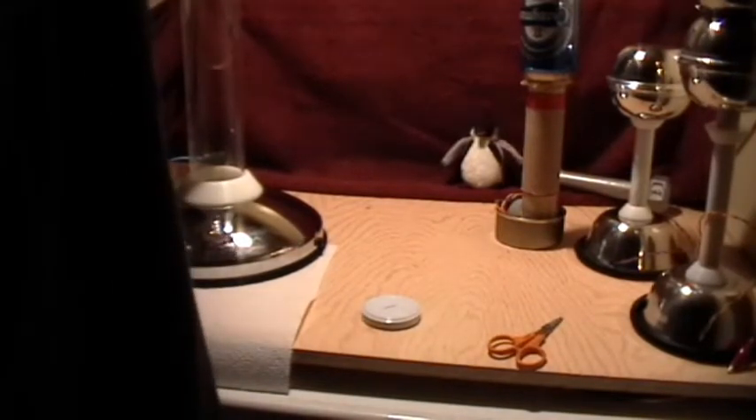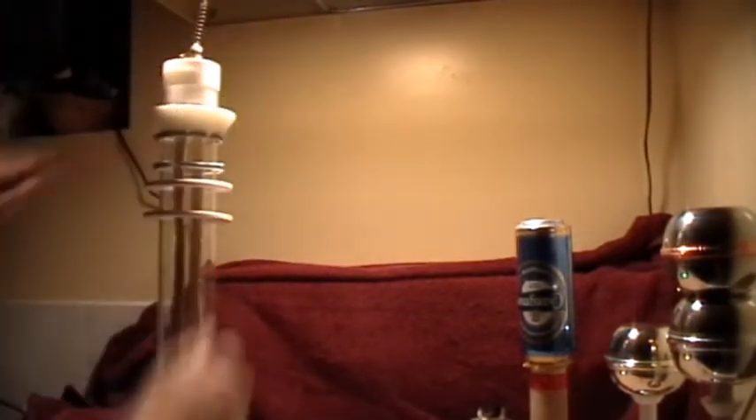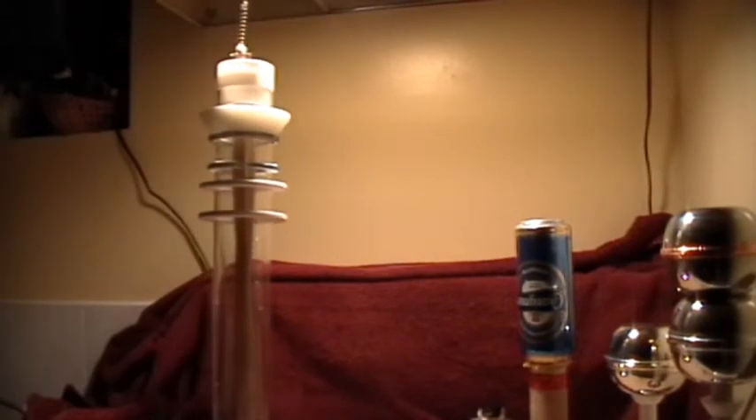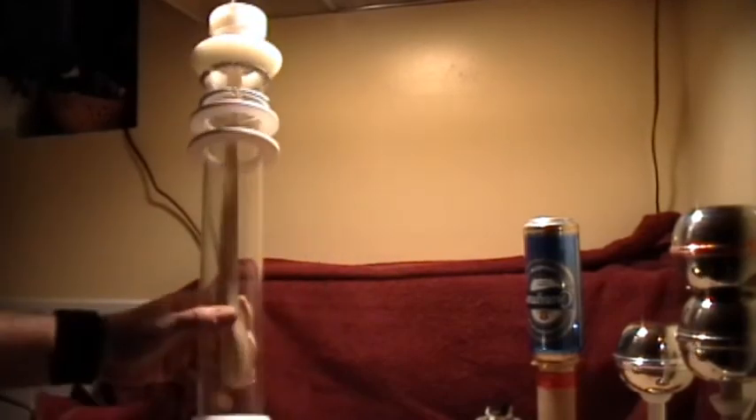I made the belt like that — there are three splices in this belt. I put the belt on — I'm dangling it in the tube — then drop the top roller in there. The reason I designed it this way is because you needed to be able to take the top capacity off and on without taking it apart. Now I've got the belt dangling down in there, and a really handy tool I found is a chopstick — a bamboo chopstick with an alligator clip crimped to the end. The bamboo chopstick is actually a high voltage resistor that will allow you to bleed charge away from charged objects through your body without getting a big shock. The alligator clip is useful for holding things in the field and for pulling the belt down.